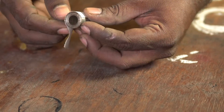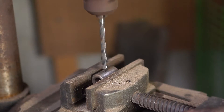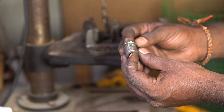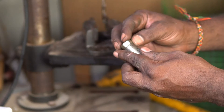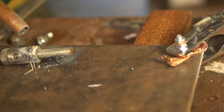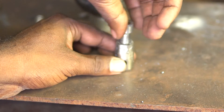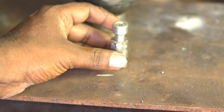We need to drill three holes on the bush, and the diameter of these holes should match the diameter of the copper pipes I'll be using as the steam outlet nozzles. After drilling the three holes, I decided to weld a nut on one side of the bush. I made a quick makeshift jig, held it in place, and did the welding. After welding and grinding, it looks like this, and now we can thread the bolt on top of the nut we just welded.